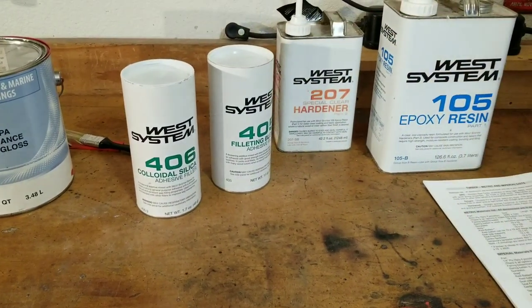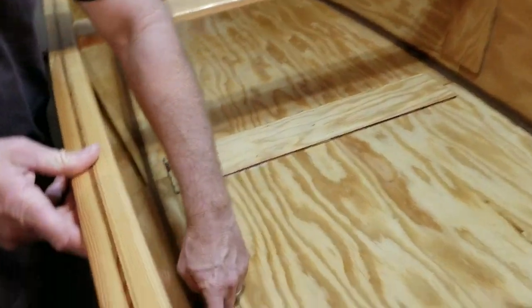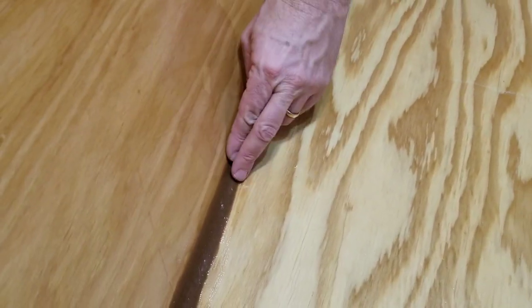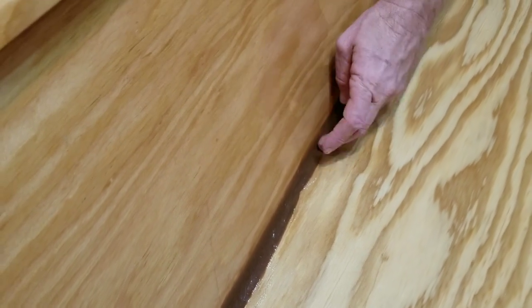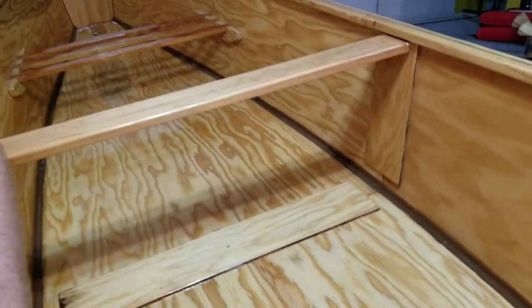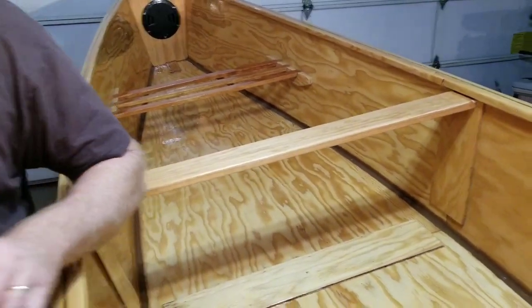A fillet joint is the joint on the inside — it creates like a thick bead of caulk that is very hard, and once you epoxy over it, it gets shiny and smooth. You can see mine are probably bigger than they needed to be, but that joint is a common boat building practice on inside joints. I used it in a few other spots, but that was the primary use.